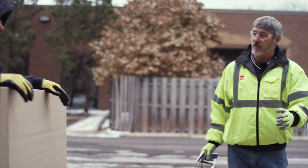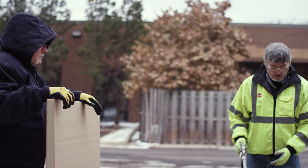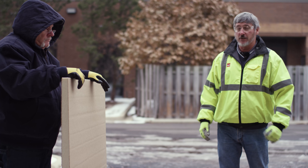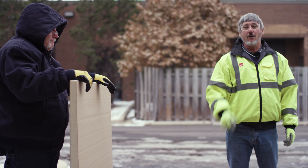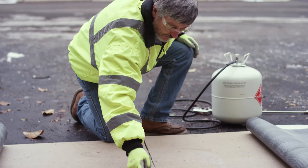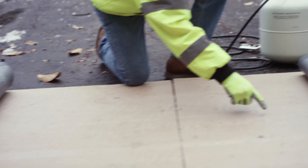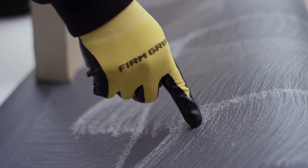So how do we go about testing this to see if it's set up enough to lay it in? You use the dry knuckle test. Obviously it's cloudy today and it's colder, so it's going to take a little longer to set up versus if we were in Florida at 85 degrees and sunny — it's going to set up right now. So we've got to wait. Take your knuckle, your finger. You can see that's still not really set up — see how wet it is? Give it a few more minutes here.